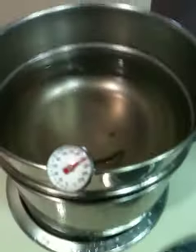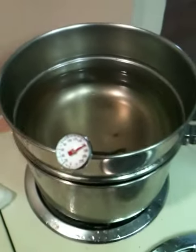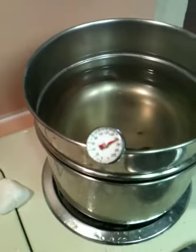We don't want to do any internal damage to these pickups. So I'll be putting them down into the melted wax and simply have the connector like it is — you can see it right now — with this bottom end poking up so it drips in there. When the last bubble comes out, the job's done. Pretty simple, at least that's what they tell me.